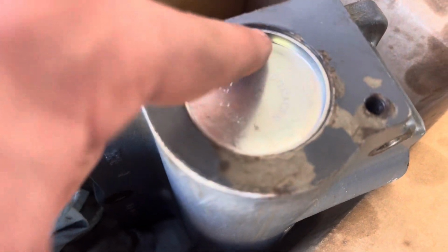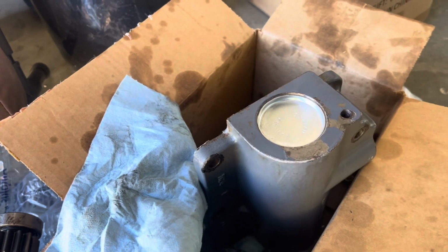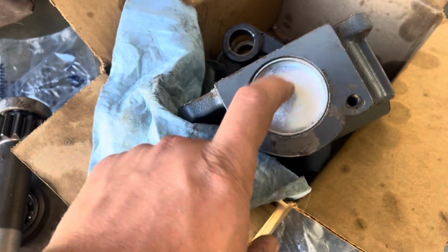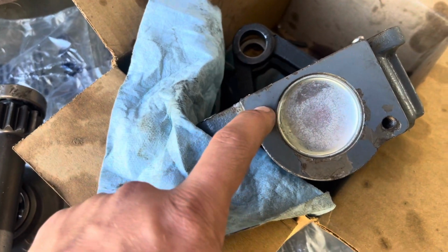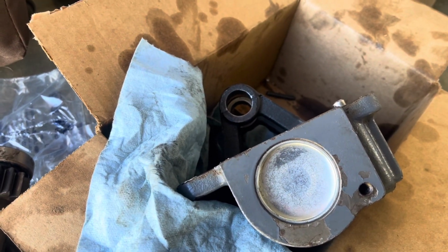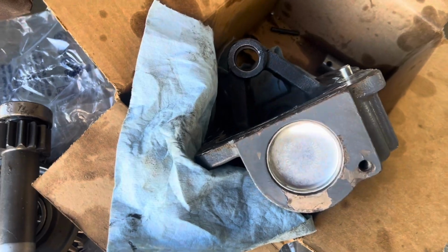As you can see, I've got this thing in there 1/16 all the way around, nicely pressed in. I had to swap over to a smaller socket because I didn't account for shrinkage trying to drive this thing in. But it went right in, nice and smooth. So I've got an idea, because now I run the risk of something blowing this thing sideways or popping a hole in it. See that hole? It looks like one could go right there, don't it? Build a cover plate just to protect it from something blowing into this freeze plug and putting a hole in it or knocking it sideways so it lets the oil drain.